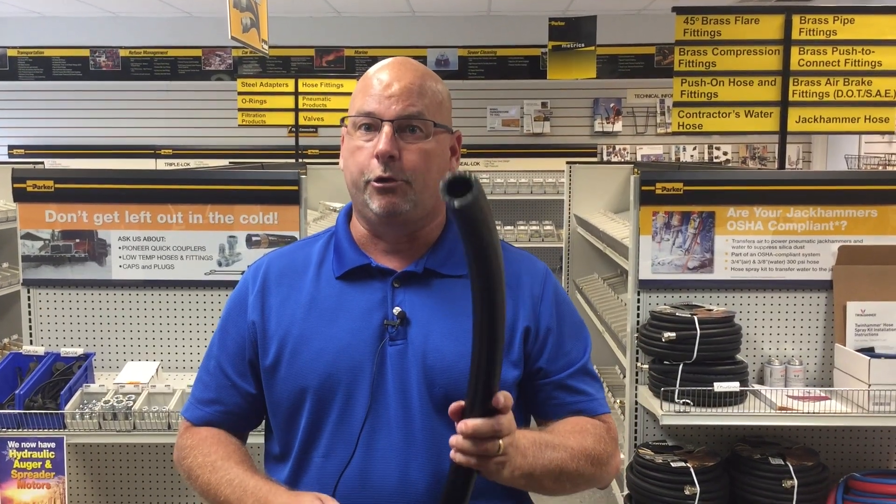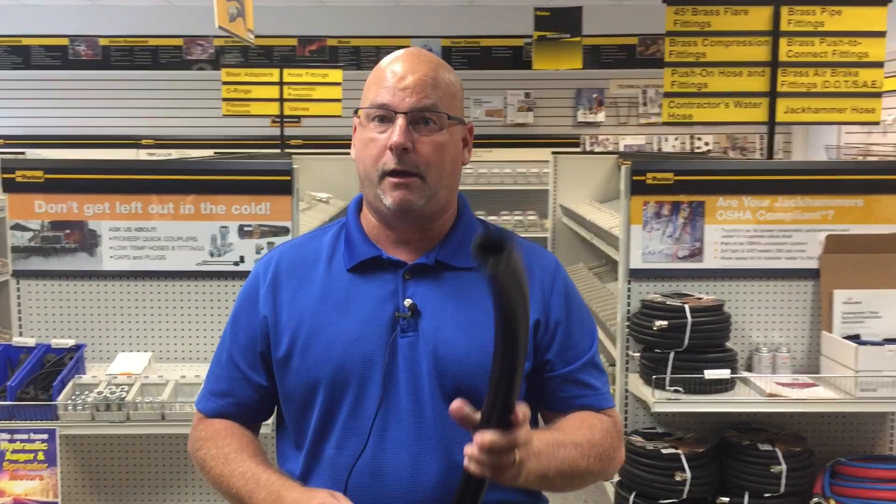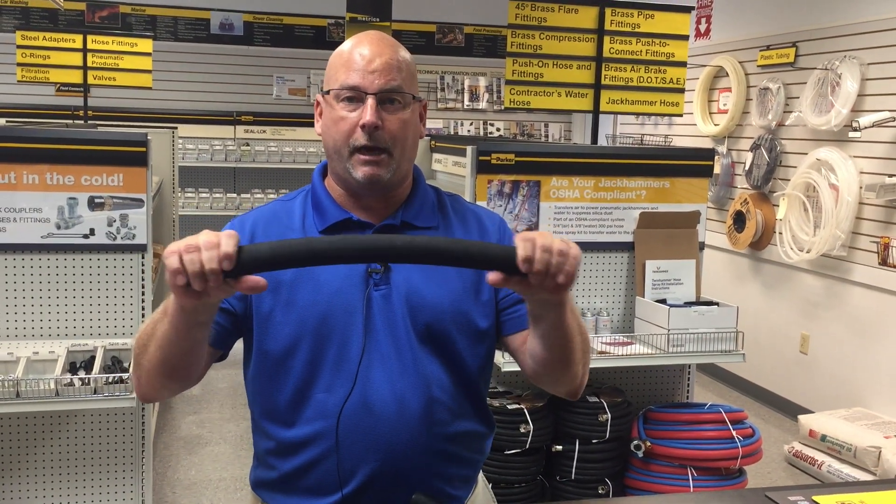That's when you call the heavy duty, or what we call the spiral hose. This is designed for higher pressures, but it's also designed for impulse applications. So if you have a 4,000 PSI two wire hose in an impulse application, this hose is going to fail a lot quicker than the spiral. This doesn't have a friendly bend radius, but when you're dealing with an impulse application, you don't want a lot of bends in your hose anyway.